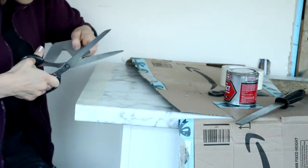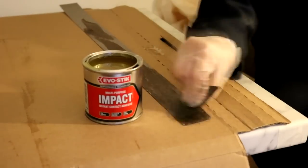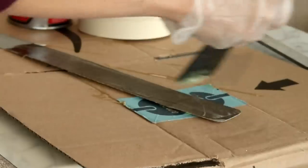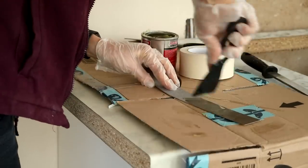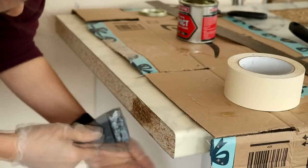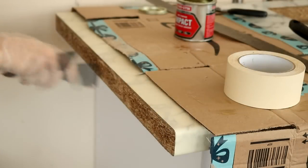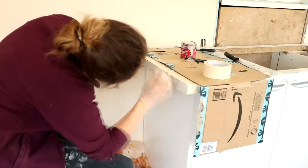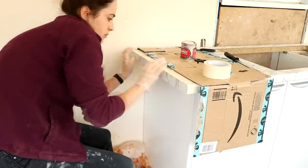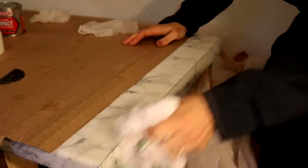Cut it slowly with sharp scissors, as close to the pencil mark as you can on the outside, not the inside — you don't want to cut it too short. You'll need to open a few windows because this contact adhesive stinks. I'm using a plastic filling knife; it did come with its own applicator but it was curved so I went for this instead. You don't want any lumps showing through once you've put the edging in place. I repeated the gluing method on the cut edge of the laminate — you're meant to leave it till it's touch dry within five to ten minutes, but by the time I'd finished gluing the worktop it was ready to use. Once you put it on it's very sticky and you probably won't be able to move it, so take the time to line it up perfectly along the top and sides, then apply pressure with your hand or an old rag and firmly smooth over it.